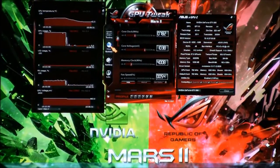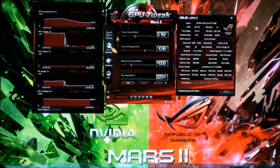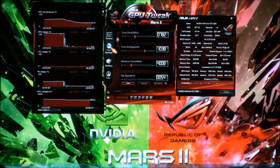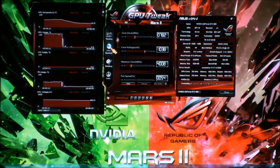Our main focus here is to show you how to complete a BIOS update. Normally, BIOS updating for graphics cards used to be a very complex and laborious process, and a lot of people were scared about it when a vendor released one. Here at ASUS, we've always tried to make the process very streamlined — we made an executable package where all the user needed to do was go to our support site at support.asus.com, download the file, double-click it, and it would apply.